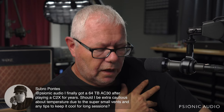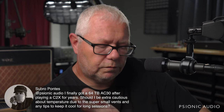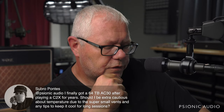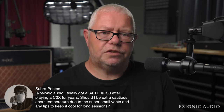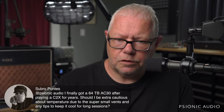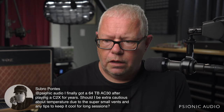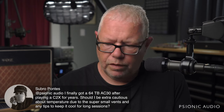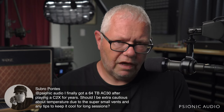But in the UK, not only are they on 240 volt versus 100, let's call it 120 here, though back in the 60s it was 110 and closer to 220, they're also on 50 hertz power. We're on 60 hertz power. So when those power transformers were spec'd out, I believe the tap says 110 for US use. That was 110 at 50 hertz, but we have 60 hertz.